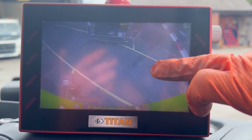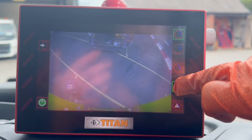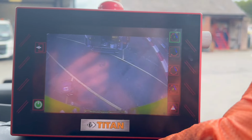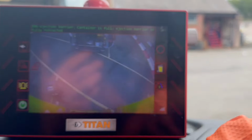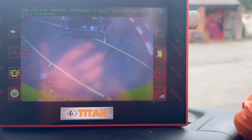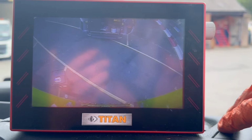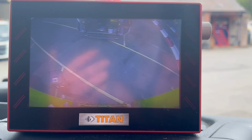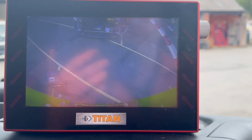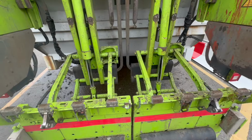So what I did before, create the continuous cycle, you press that button, press number two. It's now gone back to two cycles. Eject. Come out of that. You can see that it's showing two cycles. So you press the start button, it'll cycle twice. So now I need to drop the packer to the bottom, fully open the sweep blade, and we can check the oil level then.